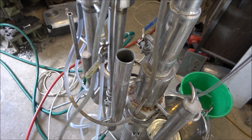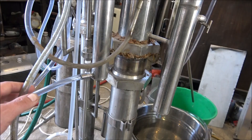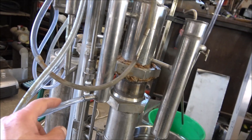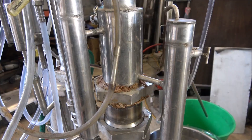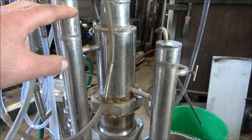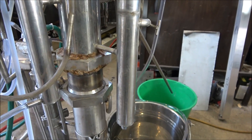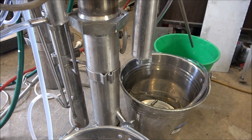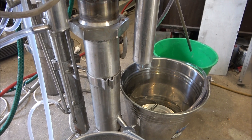There's a control valve that controls wash supply into the still, and through this tube 50% stripped alcohol goes into this bigger diameter tube. It acts more like a liquid lock tube filled up with alcohol, and with the help of gravity it pushes alcohol into this extra column that's attached and installed on top of the steam generator, which also heats it from the bottom.